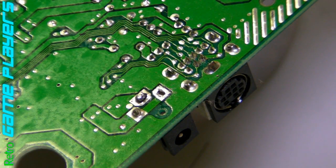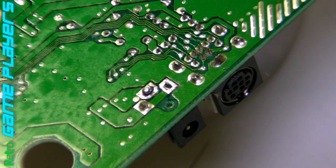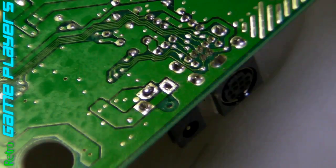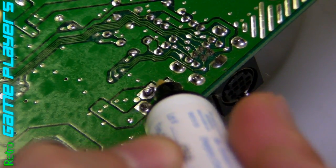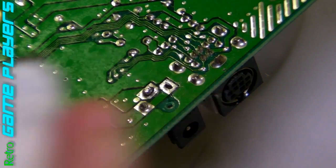Now because I've got two out of the three done, if I do any more it could actually fall out — and that's okay, I could clamp it. But what I'm going to do now is actually solder the side furthest away, then I'll desolder the other side. So before I do any of that, I'm going to take this flux pen here and just draw some flux on it. Flux helps the solder flow.